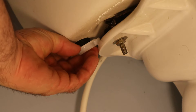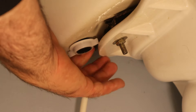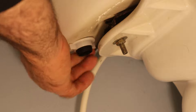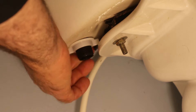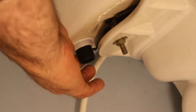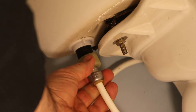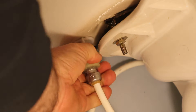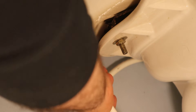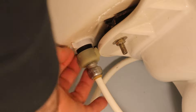This has to get threaded because of the edge of the toilet — it has to get threaded above that. I'm not going to tighten it down yet because I need to be able to get the supply line on too. Attach the supply line. You could put some white plumber's tape on the threads, but I've never found it to be necessary for this. Now I can tighten this down.